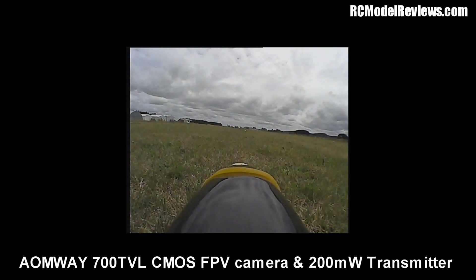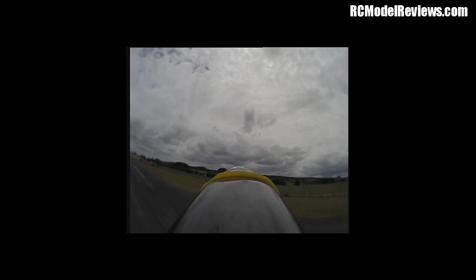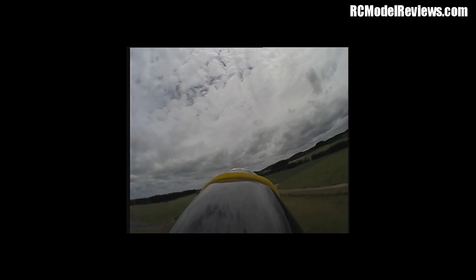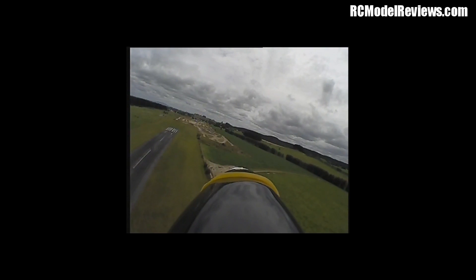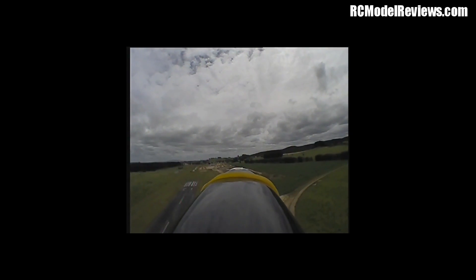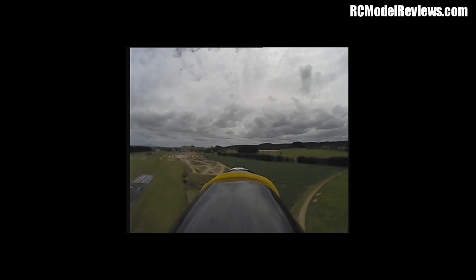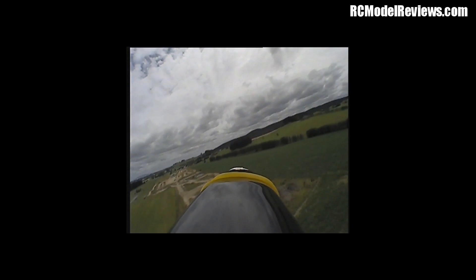The conditions for testing this FPV camera were quite trying today. There's a lot of bright white cloud, which is going to really test that wide dynamic range, because even cameras like the HS1177 and the regular Sony 600 TVL camera struggle in conditions like this. When you get a lot of white cloud in the field of view, the AGC winds down and makes the ground look darker. Unfortunately, there's not a lot you can do about that. Also note that my DVR affects the resolution — it's much sharper in real life than what you see from the DVR compression.